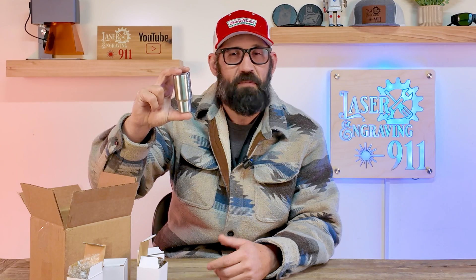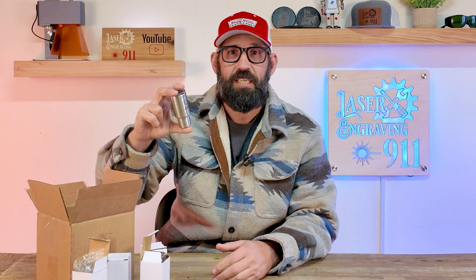I hope you enjoyed this episode of Laser Engraving 911. I'll list links in the description on where you can get some Brilliance laser ink — if you have stainless steel projects you'd like to engrave with your CO2 laser, it's my go-to laser marking spray. Now you know you can do mini Yetis on the CO2 laser two at a time. A lot of the applications we used in this video can be applied to other types of cups as well — next time you get a large batch of 20-ounce cups, you could also bond those lids together and potentially do two cups at a time. If you got value out of this video, smash that like button, hit subscribe, and leave a comment below with your laser hacks for engraving cups or using your rotary tool. Until next time, I'll see you around on Laser Engraving 911.